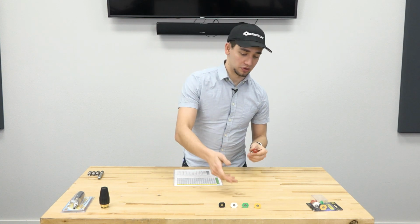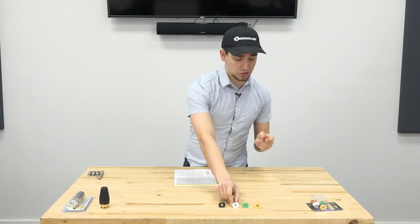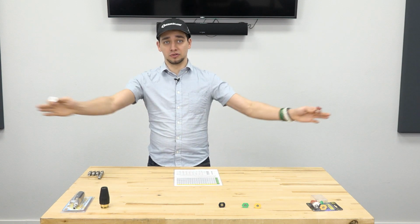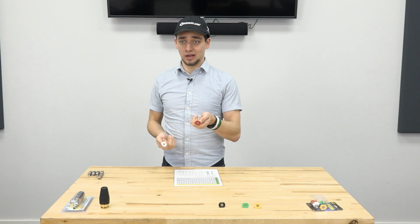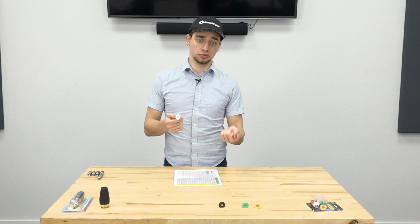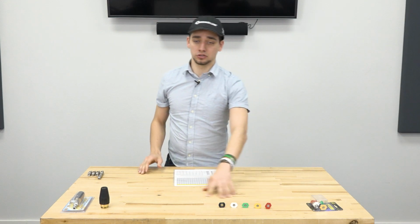So for example, when you're washing buildings or other things where you don't need that much force of pressure, you can use one of these 40-degree tips and it'll fan it out a little bit more, making it a little bit easier on you to get things done properly. Obviously, you'll have a little bit more cleaning power with something like a 0-degree tip just because all your force is focused into a certain point. But these different degrees of spray and spread just allow you to customize what you want to do and where you want to use them.